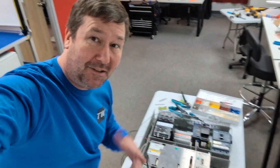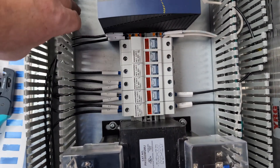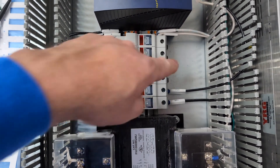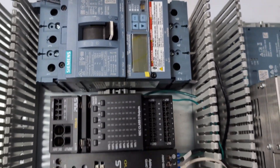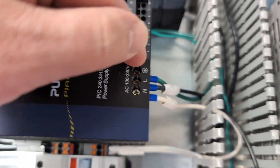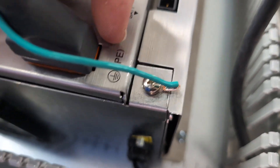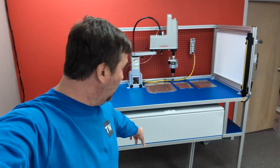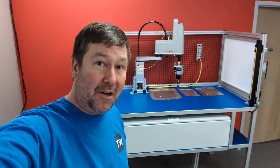Now we continue wiring the rest of this panel — I'm not actually going to show you all of that because at this point it would be a boring video, but I did want to give you an example of what you should be looking for in your control panel. You should be looking to get as straight of lines as possible and use good labeling. In the next video, we will talk about all the labeling that should go on our device components. One thing I do see missing from a lot of panels is grounds — anywhere you see a ground symbol, you should have a ground. Notice over here on this RCX 340 from YRG, there is a PE with a little ground symbol on it, which means we do need a ground right there. Now that it's all done, we're ready to mount it in our enclosure, and then we can start wiring our field devices.